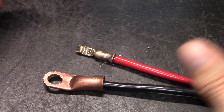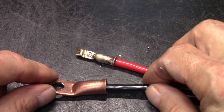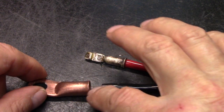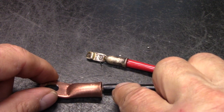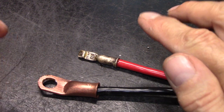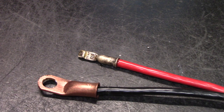The final stage of your amplification is your amplifier. So even though you see 50 ohms at your antenna with your analyzer, your SWR meter, as you draw current, joules, through this solder connection on your ground, your main ground, as this impedance changes, or you know the resistance changes, it's going to change what your amplifier sees at the antenna. These are what are called RF and DC potentials. They must be equal.